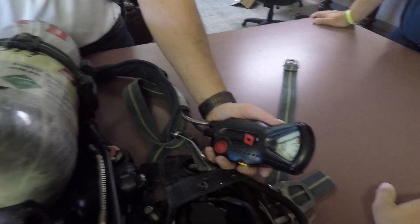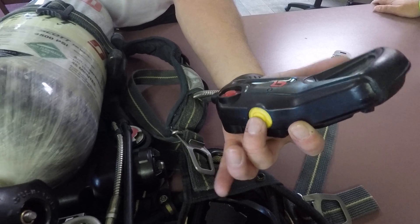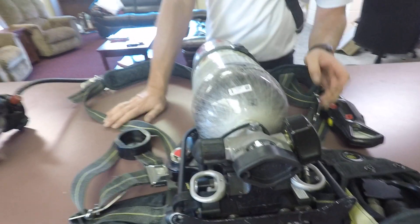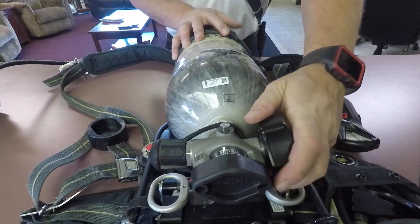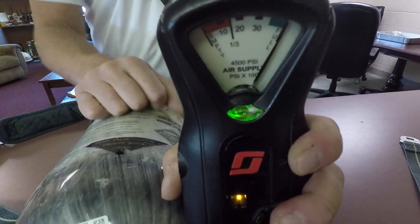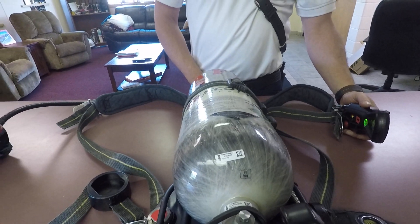It's still reading zero because we haven't turned the valve on. To check the batteries on this pack, hold the yellow button down — you can see the light turn green, which means the batteries are good. If it turns yellow or red, they're depleted and need replacement. Now we'll power this up — you'll hear it chirp. Make sure the purge valve is closed, and verify that the gauge on the ECM matches the gauge on the bottle, within 10%.